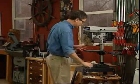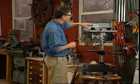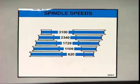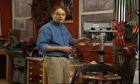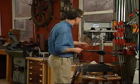Now, the other thing that's really important is look at the speed range here on the pulleys. A lot of drill presses work on pulley drives and belts like this. And you can see here's a speed chart. And don't forget, there's a printable file already in the library that gives you the speed ranges for various sized drill bits and different activities on the drill press.